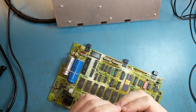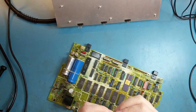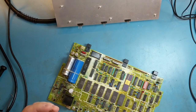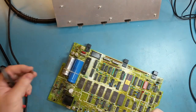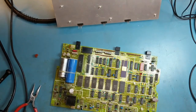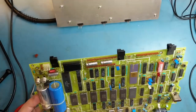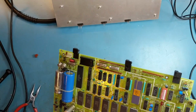I've noticed two things happening to these connectors over age. One is that the gold, even though it looks like it's gold plated, becomes a little tarnished. And then the fingers weaken, so they're not pressing against the transistor pins as hard. So it's possible that they could be losing connection. I don't think the corrosion is helping matters either. Pop the new one in.